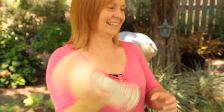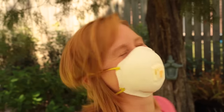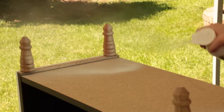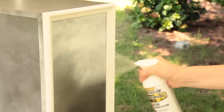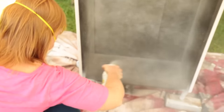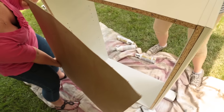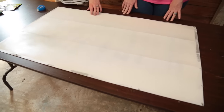After a quick wipe down, we're ready to paint the bookcase. When using spray cans, always apply in multiple thin coats. It's tempting to try and cover everything in one application, but you'll almost always end up with ugly paint runs and uneven coverage. Overspray can sometimes get out of hand, so it's important to paint in a well-ventilated area — preferably outside over a drop cloth and under a tent. Once everything is dry, we remove the back panel so we can shift back inside to cover it with fabric. We spray it just enough so the dark color doesn't show through our light-colored fabric.